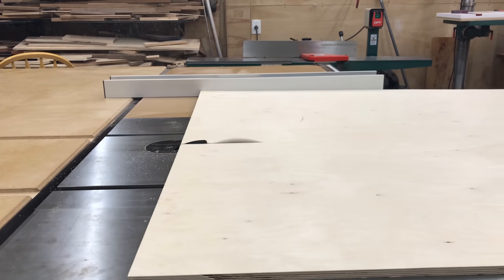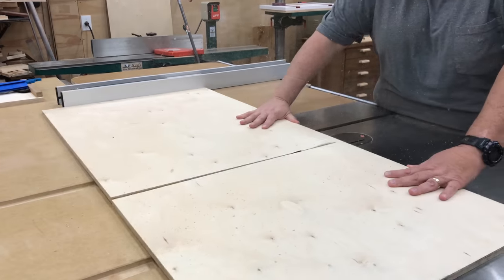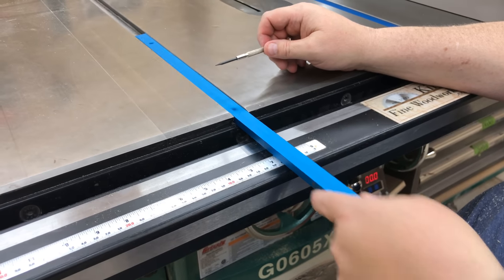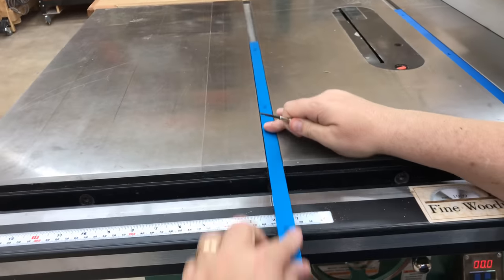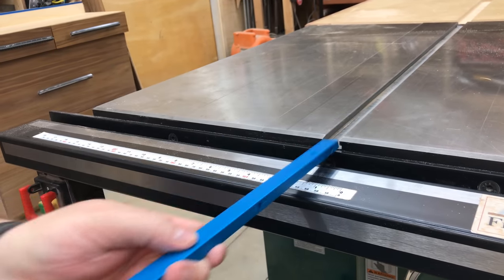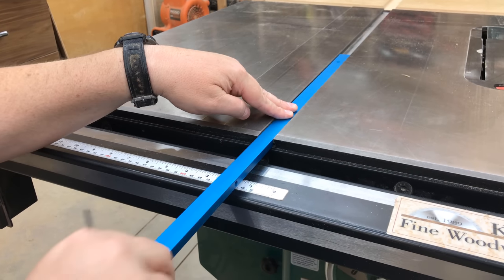To start with, I used half-inch Baltic birch plywood to make the sled — it took a little less than a half sheet. I laminated it up in a couple of layers thick in order to have the ability to make the zero clearance insert plate. I chose aluminum miter bars because I can adjust them for a perfect fit right away and I don't have to deal with expansion or contraction from wooden miter runners. If you decide to build this, I will have a link to the plans in the description — a highly detailed set of plans in 3D including a complete materials list, cut list, and everything you need.